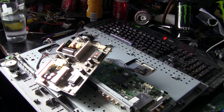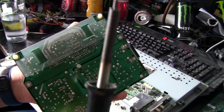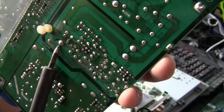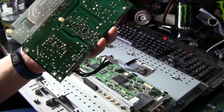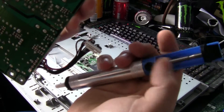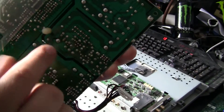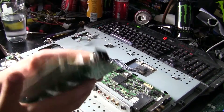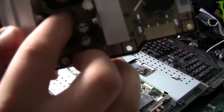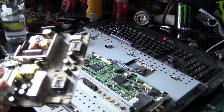To get them out of the board, use a soldering iron, heat up a pad — these are called pads — and what you want to do is get a solder sucker, heat up a pad and then suck the solder off. Then they've just come off the board; just wiggle the component a bit and they will come out, and it will leave you a nice clean hole. The two capacitors I've taken out were down here — there are two clean holes down there.